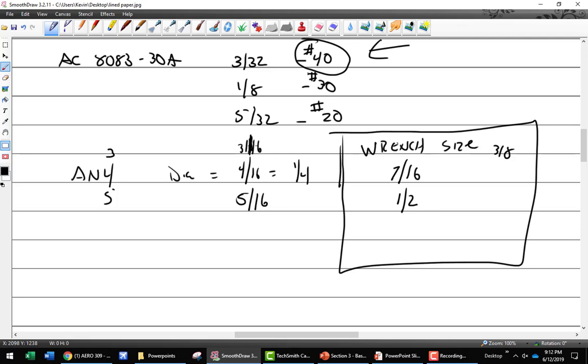Pretty sweet, huh? Hey, while I'm standing here and I'm doing this, what decimal equivalent is 7/16 exactly? 0.187. Because we already know, everybody should have that memorized, right? I sure as heck don't. See this little key right down here with the arrow on it? Right above it says F, arrows each way D. That stands for fraction to decimal. So if I hit this second key, this green key, it's going to activate all the green keys. And now I'm going to come down here to this arrow key, and it's 0.4375, which means that you did not have the right number. You said 0.18 something? Yeah. I just misunderstood. Oh, okay. I understood what you said. So everybody see how to get a decimal out of a fraction? Did you follow?